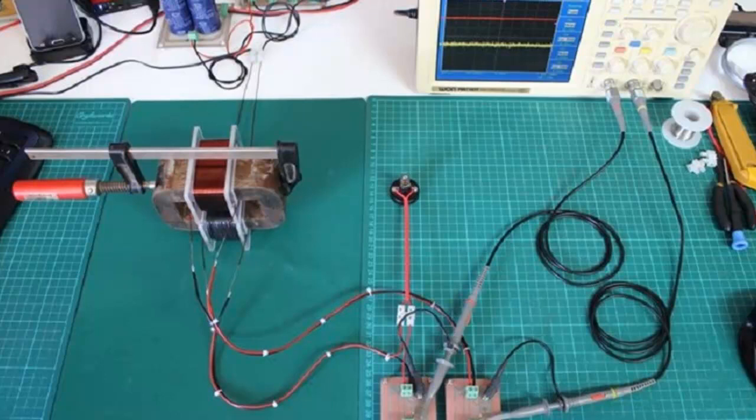What people need to start thinking about is that these coils have a magnetic field, and I've said all along it's the magnetic field that does this changing in time. Well, what can you do to increase the magnetic field? First thing you do is shorten these coils up, make them half the length or something like that. You can double the turns, double the current. NI is the ampere turns, which is the same as magnetic force. Coils will respond quicker if they are shorter, because the magnetic field will be stronger, and faster in changing in time. So people need to start thinking about this.